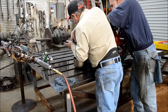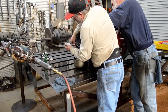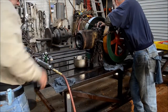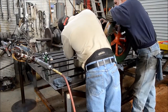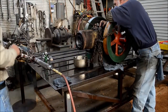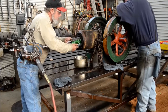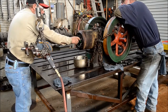It's running around within half a thousandth. About three and a half to four thousandths — we've got a half thousandth variation in one place where it's a little bit bigger than the other. Not bad though — half a thousandth. He's squirting diesel in there as I'm honing — squirt can flushes the cuttings out and keeps the stones free so they continue cutting.